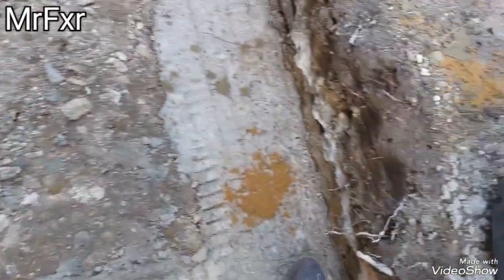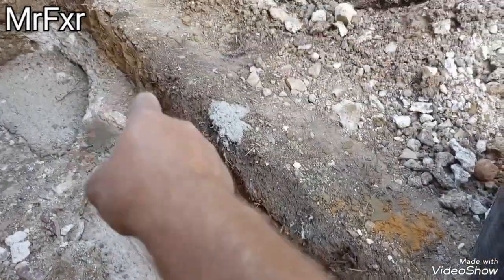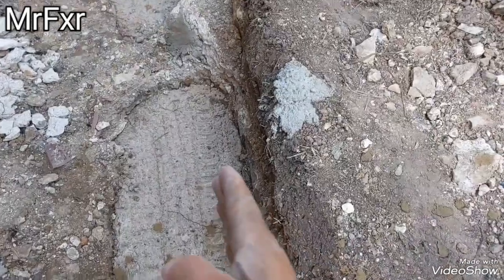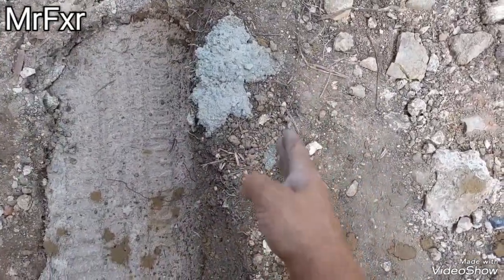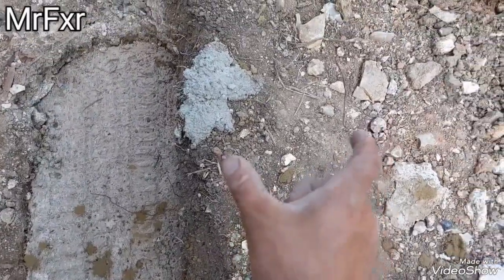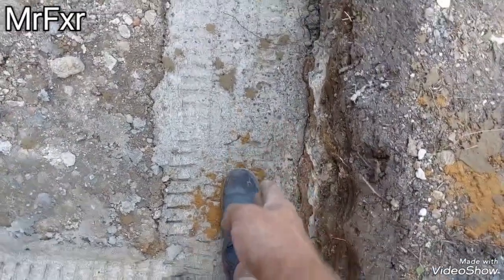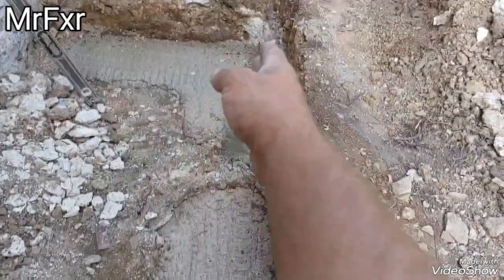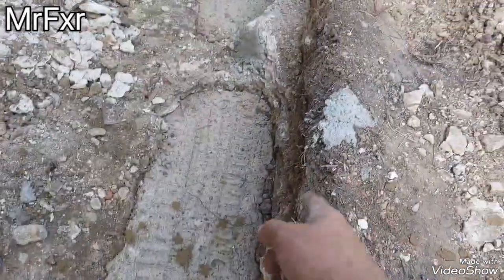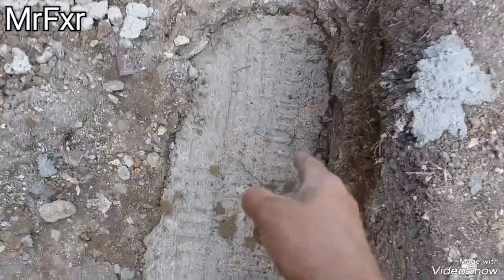Transfer there, that's where we're gonna run another course of the blocks that way. Now, because of the drain that goes along this trench and this footing, I can't build on top of that directly. And that's really where I want to go with my wall here. So what I'm gonna do is build a wall off the footing along here, about 4 inches, 5 inches away from the pipe. So all the load is gonna go on that wall, on the footing below the pipe.